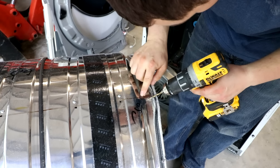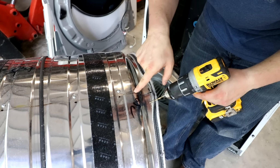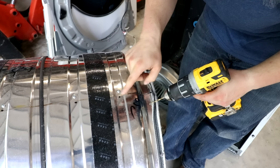I'm going to drill a couple of real small holes. The crack starts here, runs all the way in, and tees right here, going out in both directions. So I'm going to try and find both ends and put holes there to stop it from continuing down that seam.